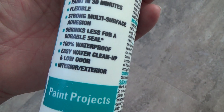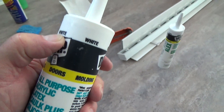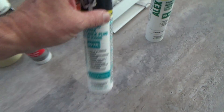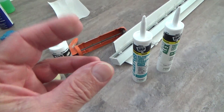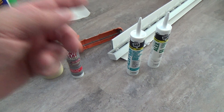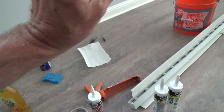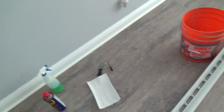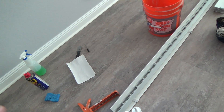This is a forty-year product, and it's designed really to be painted over. Lots of times I used to caulk around windows with this, but I found that when it dries, it dries kind of flat. It doesn't dry nice and white and shiny. When you put it on it looks nice and white and shiny, but when it dries it's going to take on a flatness and a little bit of yellowness — just an off-white — and I wasn't too happy with that.